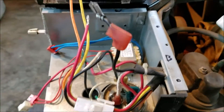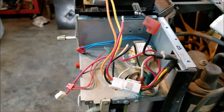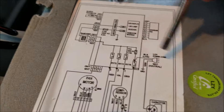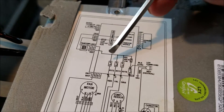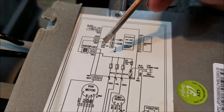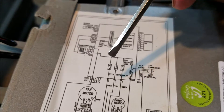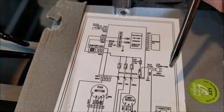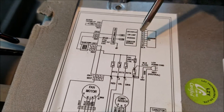The start of plan B. All I want out of this little window unit is the compressor to come on and high-speed fan. So I've got to go to my schematic to figure that out. Here's our schematic — we can see right here there's a black wire coming in, and here's the picture of the relay. The relay is not bad — I tested it, the relay is good. But there's something about the circuit board that will not tell the relay to engage. I really can't fix the circuit board, so I'm just going to bypass all that. When I'm done, when I plug it in, it'll just come on and all this circuit board stuff will be cut out.